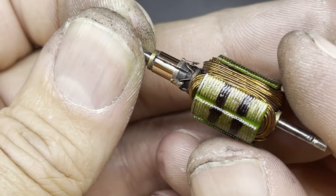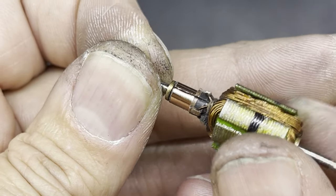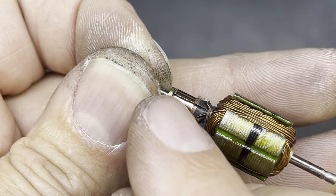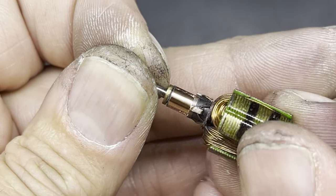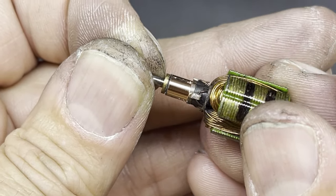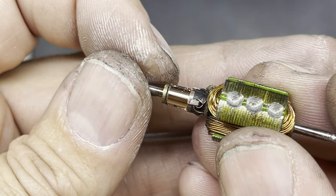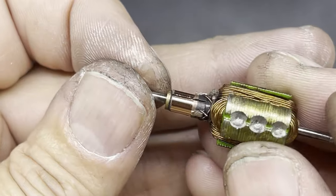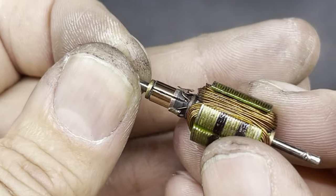There we go. I've cleaned the copper out of the grooves in each one of those comm slots. There's a tiny bit I can see now looking at it really closely so I'll give that another little clean. You can see that the edges of the comm slots are now not great — where I've cleaned the copper up there's a little bit of a rough edge, so I'm going to show you a little trick to fix that.